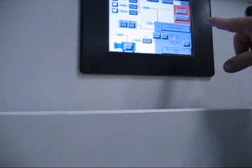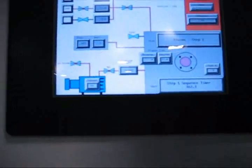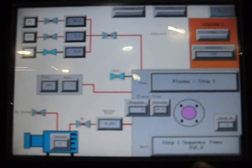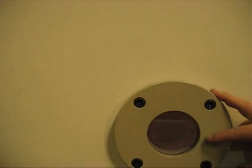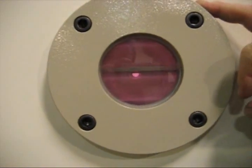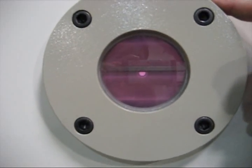As you can see on the screen, we now have gas flow — an actual flow of 99.6 of the O2 and 9.9 on the CF4. You can see a graphical representation of a plasma happening, a count-up timer, and a count-down timer, so you can have it either way. Vacuum levels are at 252 millitorr. If we look inside of the chamber, we can see that there is actually a plasma going. Right now it's a little on the pink side — there's some atmospheric nitrogen from the first startup — but as it goes, it will turn a very nice blue color, which is typical for this machine running O2 and CF4.